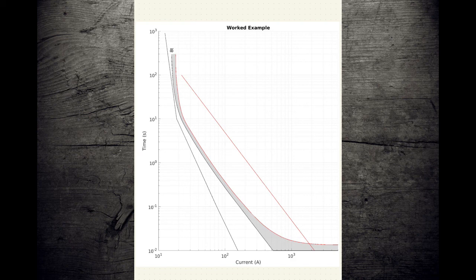And in here we have this great 8T fuse, so it's a T-series fuse with an 8 amp rating on it, and it fits very nicely in between those two. So we have perfect coordination. The transformer is perfectly well protected. We have no chance that we're going to get a nuisance trip, and our transformer is protected everywhere except for down here.